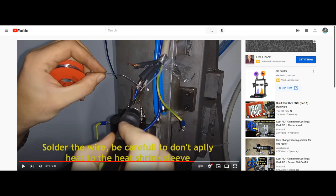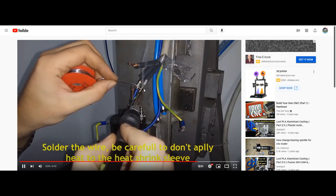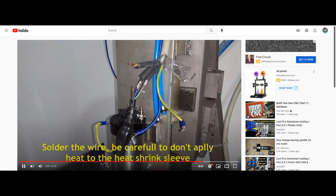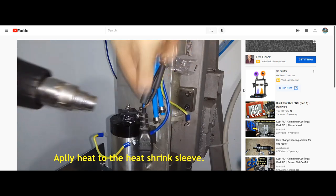Once again, we see him piecing together, and I'm just blown away here. He's piecing together the leads from the actual connector. And when I say the connector, this is the actual power cord he's piecing it on. You'll see it as we go through here. Of course, he's not using flux. And what does he keep doing? Just keep heating the lead until he feels he has enough solder on there, instead of just applying enough flux and it would naturally absorb in and wick itself through capillary action.